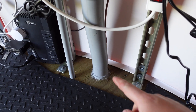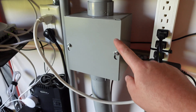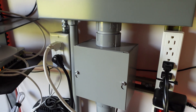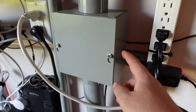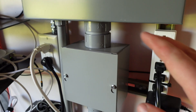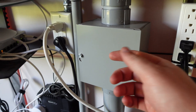Let's go ahead and take a look at the observatory side, and then we'll pop into the house and look at the house side. Right here is where we see that two-inch conduit come up into the observatory. It then runs up into a little 6x6 junction box, which then runs up into my electrical distribution panel. All this was put in by my electrician. This 6x6 box exists purely to have a place for that fiber cable to pop out before we get into the main electrical box — I didn't want to be dealing with the fiber coming out of the main electrical panel.